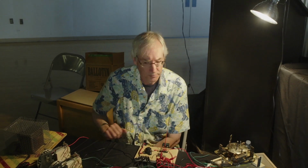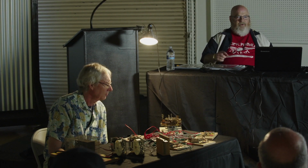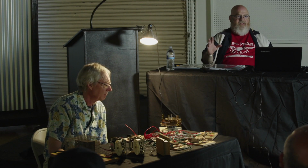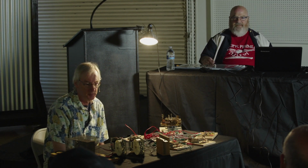Now, it does matter if you're talking about matching or high score replay levels, but there's an extra part of the wiper board that we have not shown here that uniquely identifies the 10 digits. But all the score reels are going to have those 3 switches, apart from the last one, which doesn't carry anywhere. And we'll talk more in the session on startup tomorrow about the switches that identify that 0 is showing. So that's part of the startup sequence.